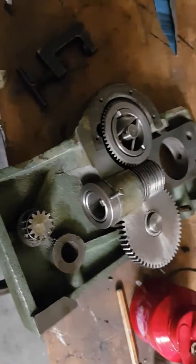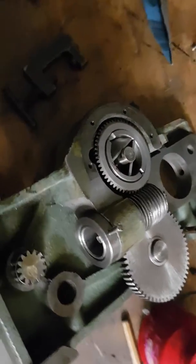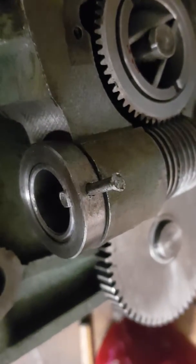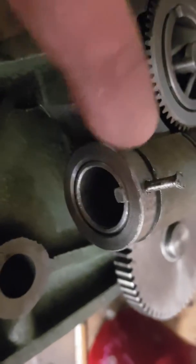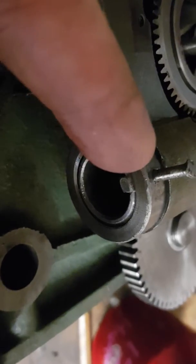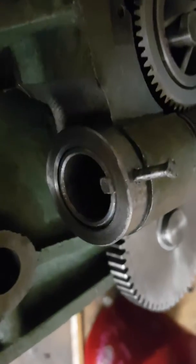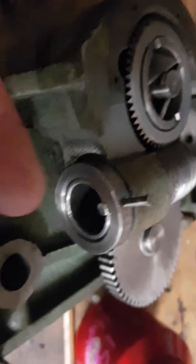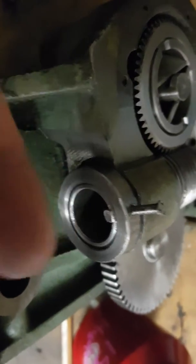I just wanted to point out something that may help you guys put one of these together and pull it back apart — dealing with your keyway. This is on the apron. That keyway goes all the way through, and that pin needs to not only go through the outside screw but also through that hole and straight through the keyway as well. So not only do you have to line it up, but you have to somehow hold that keyway in.